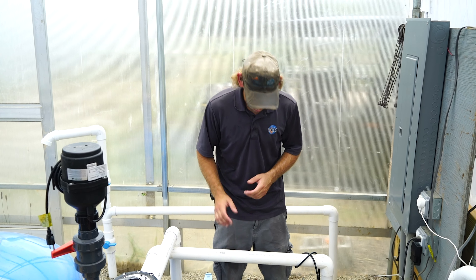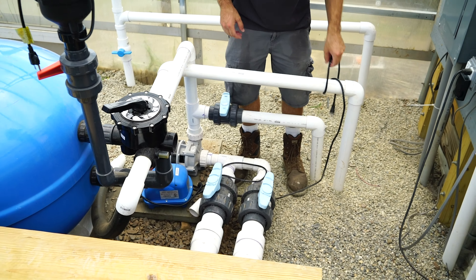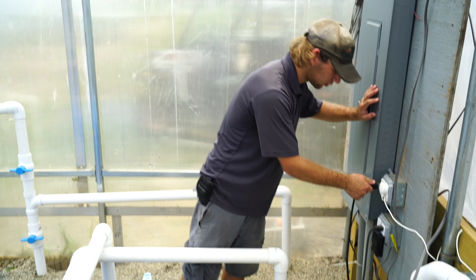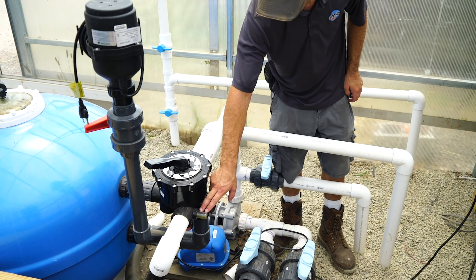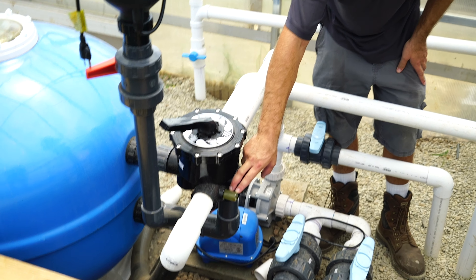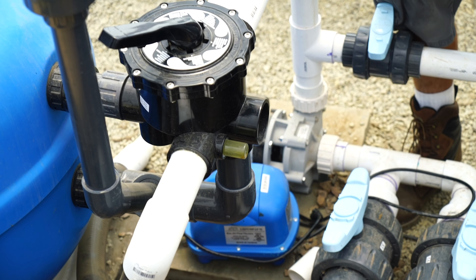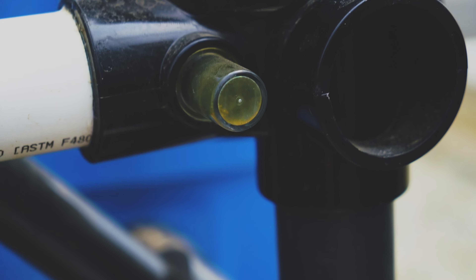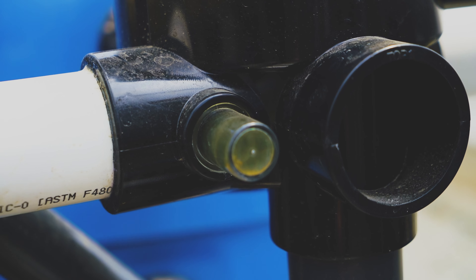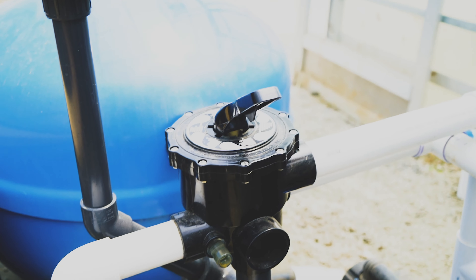From this step, what you're going to want to do is open up the inlet valves, then plug the pump back in. Right here it's going to run pretty dirty. When this starts to clear up a bit, we're going to then turn it to backwash. It's just cleared up quite a bit from when it was originally running. As you can see there's still some cloudiness, but that's going to be cleaned up during the backwash cycle, so don't worry about that. Now we turn the multiport valve to backwash, then plug the pump back in.